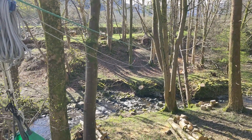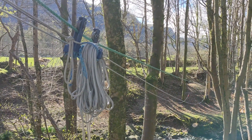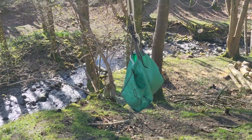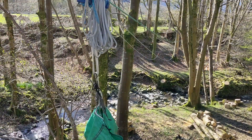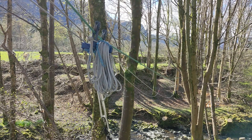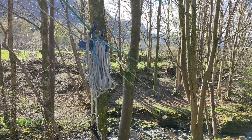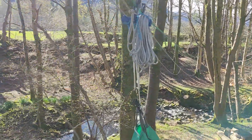In order to get it up, I've repurposed an old zip line — that's this green wire — and we've got a little blue trolley which I welded up some years ago. Rather than a seat underneath it, I've simply got a little bag underneath in which wood can go. To bring the load up, I've used a continuous loop of rope: 100 meters of double polyester rope which goes around an idler pulley at the bottom end and around a capstan winch at the top end. This capstan winch is operating in a continuous manner, as opposed to the normal manner where the tail end is operated by a user.